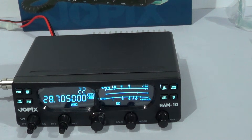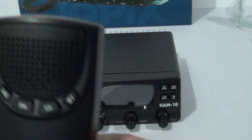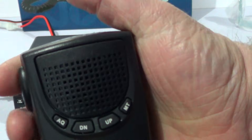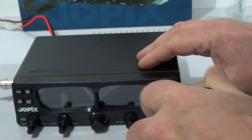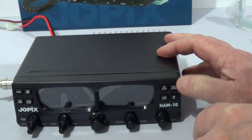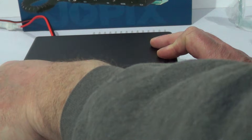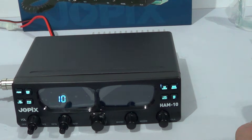So I'll show you how to open it up. It's fairly straightforward - you don't have to go inside the radio or move any jumpers or wires. Turn the radio off, grab the microphone pressing the PTT and holding it in, hold the EMG button - that's the top one - and whilst doing that turn the radio on. It displays '10', so that's your 10 meters.